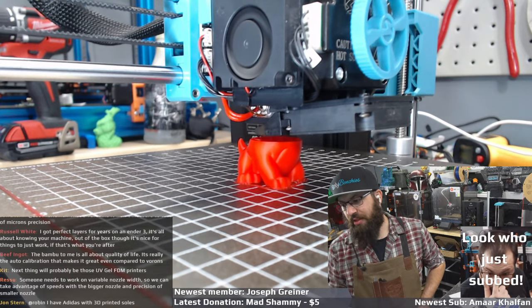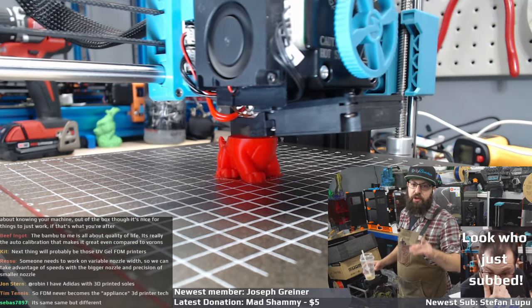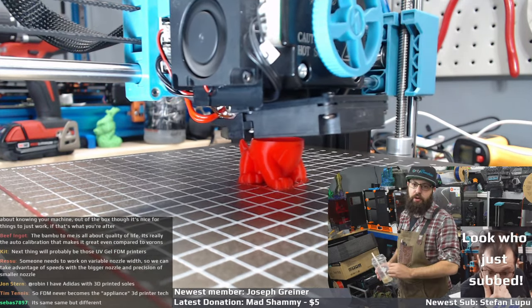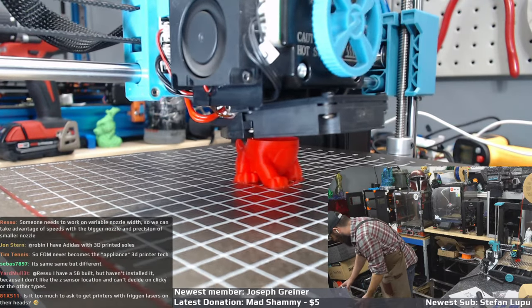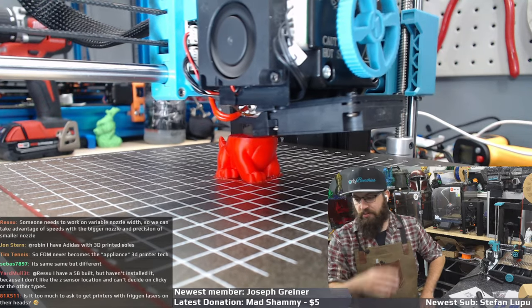We're running 60, 60, 60. No, normally infill, max out your hot end. Whatever your flow rate of your hot end is, that's what your infill should be. You should be capping out your flow rate with infill because nobody sees infill. You want that thing just pushing plastic for infill and just scooting along.